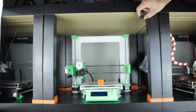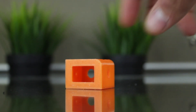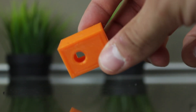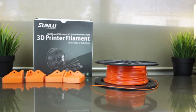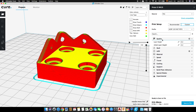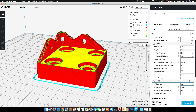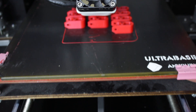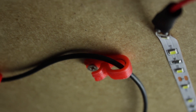I will place the power switch in a comfortable location, here in the top right corner of the gap. For that, I have designed this small piece to hold everything in place. As always, you can download all the files from the links in the description. To print this small piece, I've used the orange Sunlu PLA TG filament bought from Amazon. I sliced it in Cura with a 0.2mm layer height, two walls alternating a third one every two layers, three bottom layers, four top layers and a 20% cubic infill. I have also designed a small cable clip that you can download from the link in the description, which will keep the cable of the LED strip attached to the ceiling.